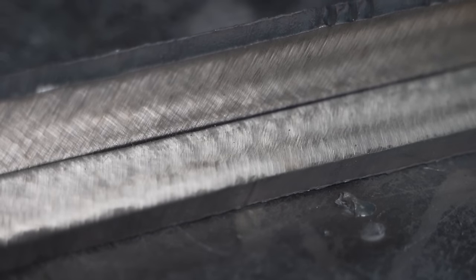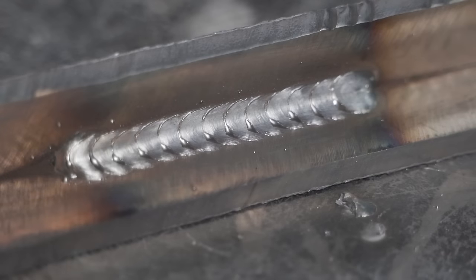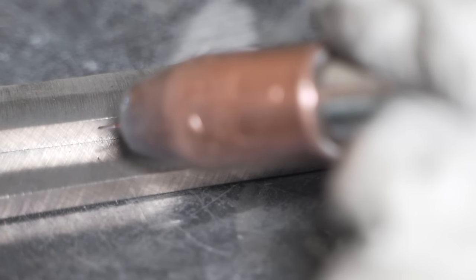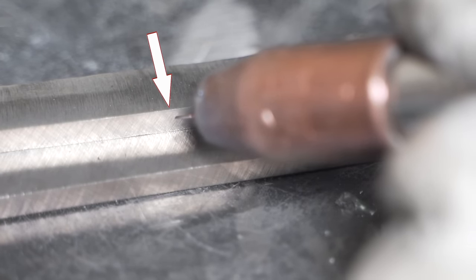Now, an inside corner joint. You can use the triangles for this one too, but I prefer a swirl pattern. Because we no longer have the lines to guide me, I find this pattern makes it easier to keep each dime uniform in size. Notice that with each pass, I trace the front edge of the puddle, making sure the arc contacts the base metal. Here's a lap weld — one plate lying flat on top of another. We now have the top line to guide us, but I still prefer the swirl pattern to keep the dimes lined up on the bottom edge.